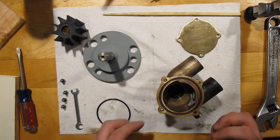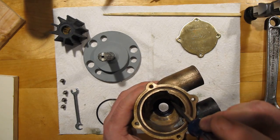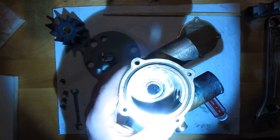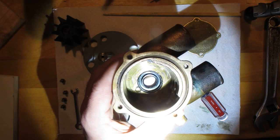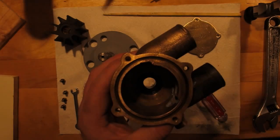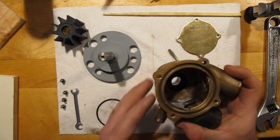What you're going to want to do is install the lip seal down here — just install it with your fingers. Make sure you don't push it too far, because if you push it too far you're going to have to take it apart again. Probably the easiest way at this point is just push it in with your fingers and make sure it's not too far in. Now we're back to putting the shaft back on the bearings.